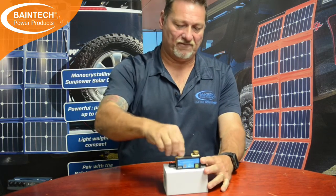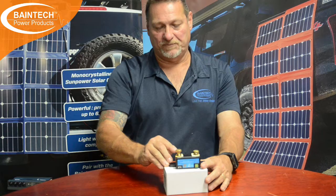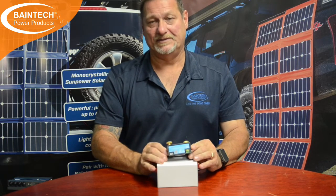Another way of doing this — because you don't want heaps of things piled up on the shunt terminal, as you end up building up resistance — the better and simpler way is to have one big cable that can carry all the current of your loads going to your battery, and the same size cable going from the system side of the shunt to a busbar. You can then connect all your negatives up to that busbar, whether it's a four, six, eight, or twelve post busbar — however many you need — and all of those negatives connect through the shunt to the battery. So hopefully that's helped and cleared up a bit of confusion. Until next time, bye for now guys.